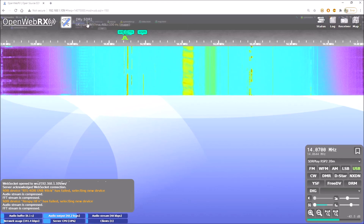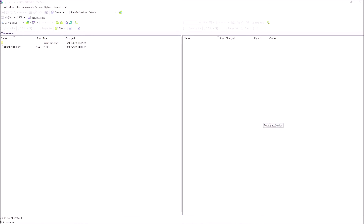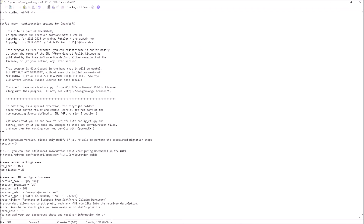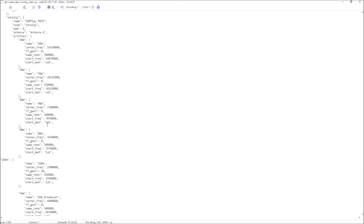I hope this was of some help. It's a little bit daunting and I still find it so — I'm not someone that knows very much at all about Raspberry Pis. I believe the language that this file is written in — the bands section — is Python. If you're familiar with Python then you probably have no difficulties with this at all. If you're not, then like I say, just be careful. If you're adding bands, go from the bracket and comma under the band above — just select that band down to the bracket and the comma, copy and paste it, and then alter the details within each one. You can add as many bands as you want here — amateur bands, broadcast bands, VHF and UHF, whatever coverage you have on your receiver. I don't think there's any limit to the number of bands you can set. The more you have, obviously you'll just have more of a dropdown.